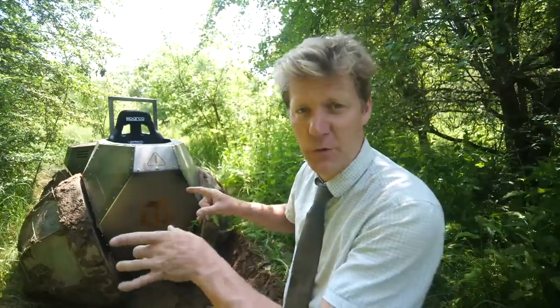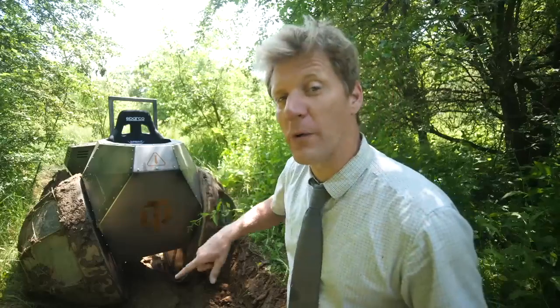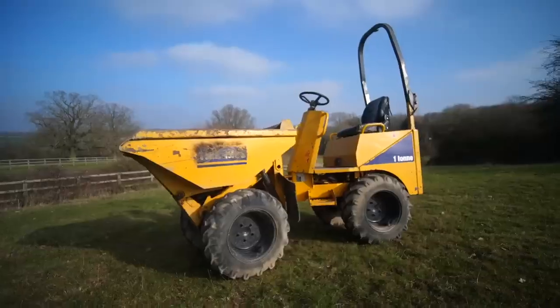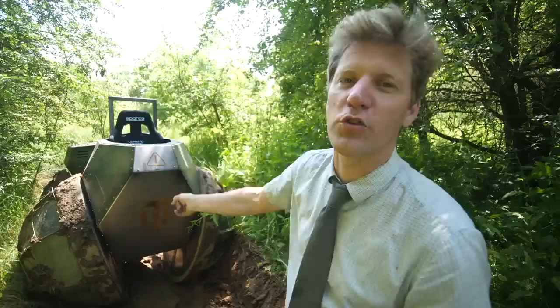The original inventor's idea is still sound — I'm calling him the original inventor, can't pronounce his name. If all four wheels turned, this thing would plough out of here no problem. But my donor vehicle, a little hydraulic dumper, had much smaller wheels on. We put huge wheels on it and basically it doesn't have the torque to spin them. The hydraulics are just pumping oil — it's saying no.